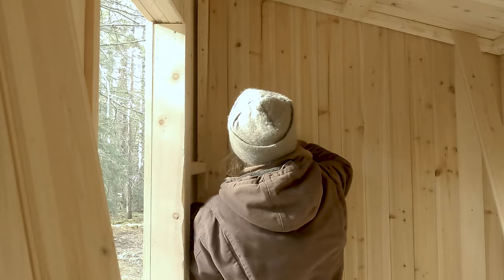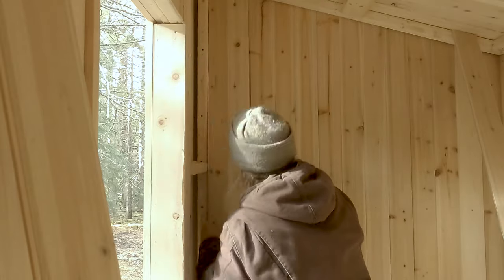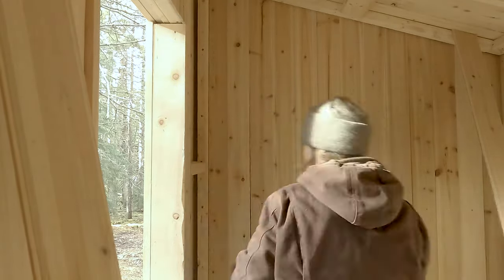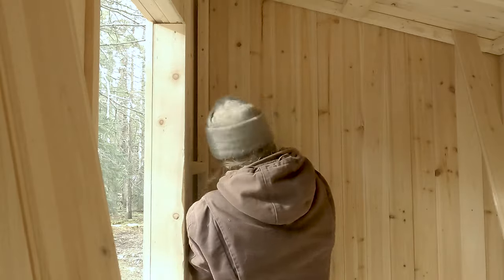Something I had to learn the hard way is that the angles of the two sidewalls are mirror images to each other, so once you cut the 15 degree angle, the cedar boards will fit on either side by flipping them around, but then you change the side of the tongue or groove, so you have to keep that angle in mind when you are cutting if you want them to all fit together.